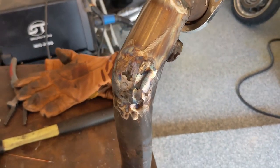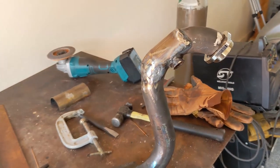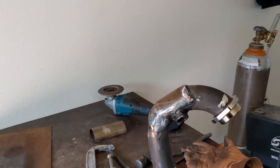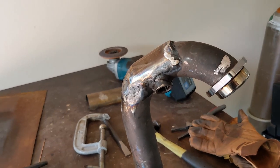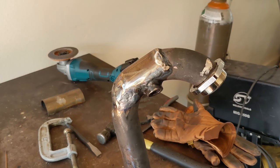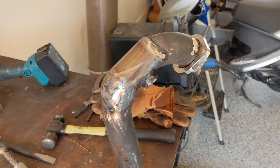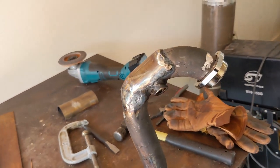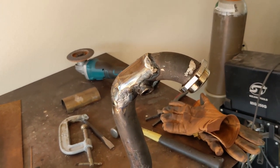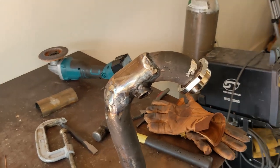There's our finished product. I've water tested it so there's no leaks. Is it ugly? Yeah, but I've got a TIG project coming up where I need to make pretty welds and TIG welding is a skill you've got to practice. I don't really care too much about this one because it's going to be covered up by that chrome piece. It came out okay, especially for dissimilar metals, because I'm pretty sure this is some sort of stainless and the other exhaust was maybe a different kind of stainless or mild steel — they definitely didn't melt the same.